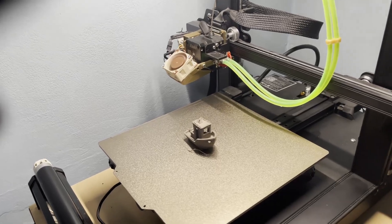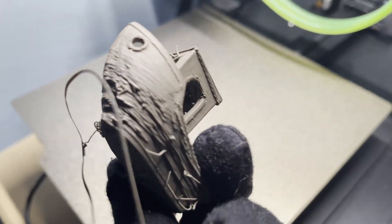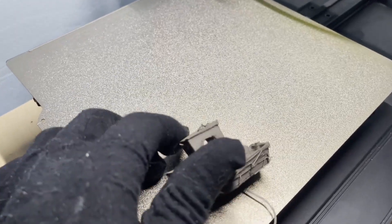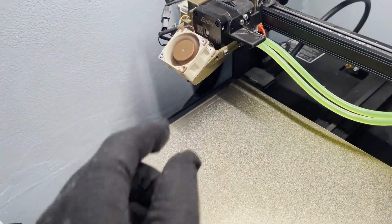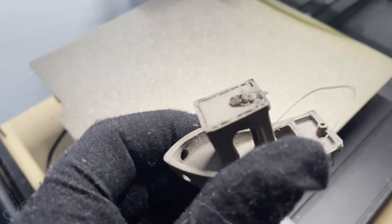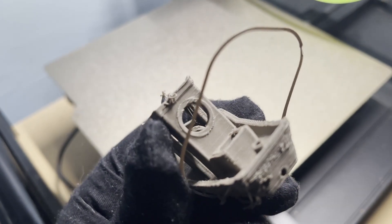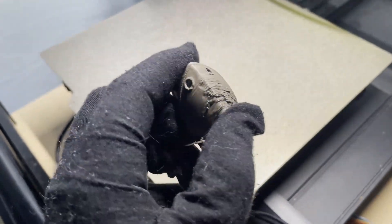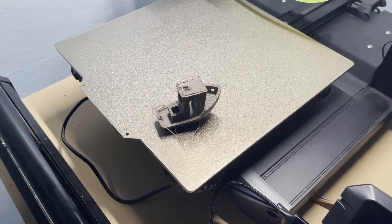Now the print has failed in the end here, so I had to stop it. This is what came out — as you can see it's a cooling issue that's been happening on this print. Overall, when you look at it, if there is proper cooling for your parts cooling fan it might even come out really good. You can see some parts that didn't need as much cooling came out really nice, but on the parts that had to do the walls it had to have faster cooling and it didn't come out well.